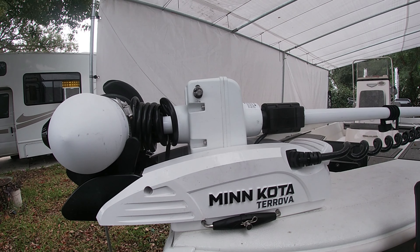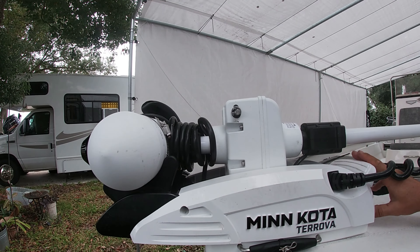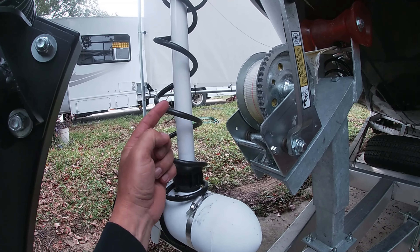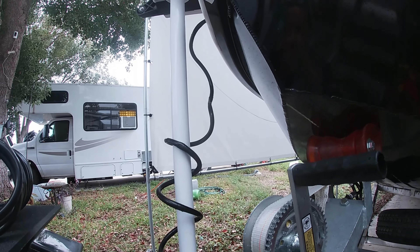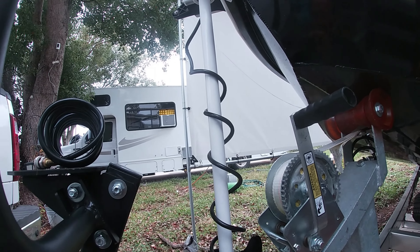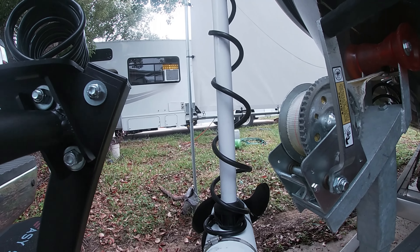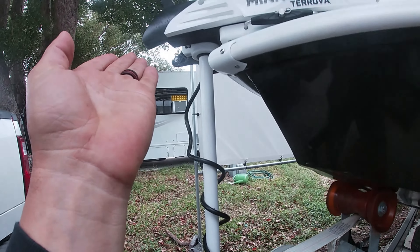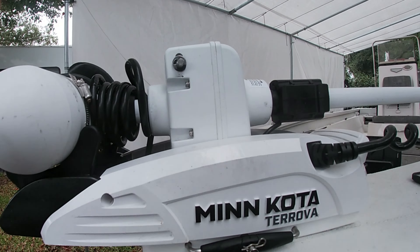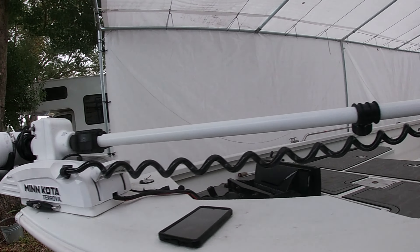This is what it looks like when the trolling motor is in the stowed position. Once you deploy it, it extends this cable with the built-in memory. You'll notice the cable with the natural memory of that compressor coil feeds up this shaft, and with SpotLock, no matter how many times you turn this thing in a circle, you've got plenty of play in your cable — that memory built into the coil keeps it turning and keeps it clean. When you go to stow it, all this compresses and goes back up into the housing. Just like that — nice and clean. You don't have that cable sitting over the top bouncing around when you run.